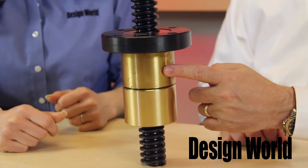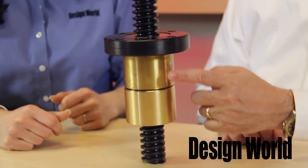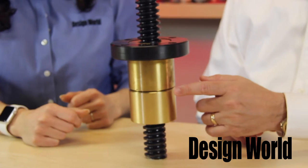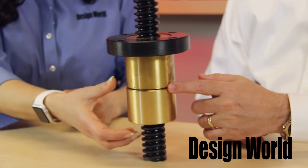In the case of a following nut assembly, as the internal threads get thinner, the primary nut will fall with respect to the second following nut. This gap will get smaller, indicating the amount of wear the thread engagement has seen. This second nut is not carrying any load, but is pinned to the primary nut so it can follow along.